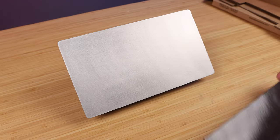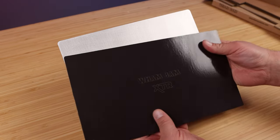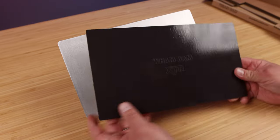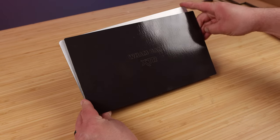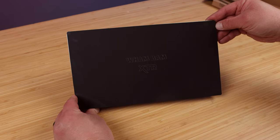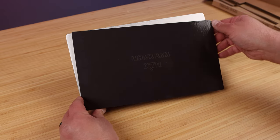At this point you need to look at your build plate and make sure there is no area that has not been scuffed up yet. It looks pretty good — went up and down, sideways, all around, and it looks pretty scuffed up. The next step is to grab your new build plate — this is pretty much universal for all their models on how you apply these. Make sure it fits the plate, make sure you've got the right size. In my case we're good — it fits the plate very nicely and we can proceed to the next step.